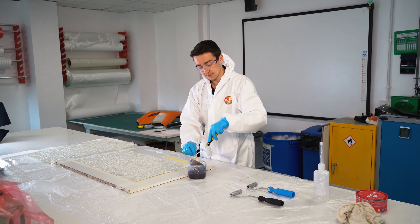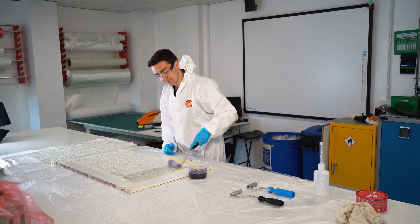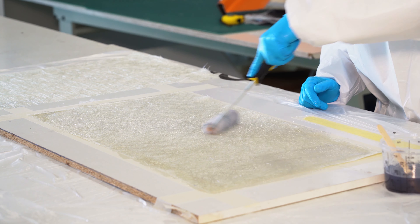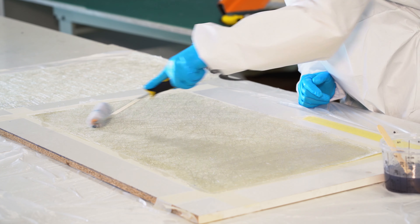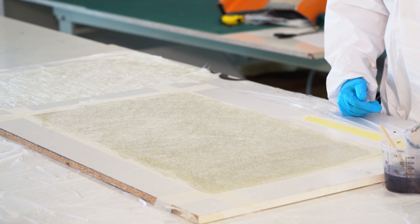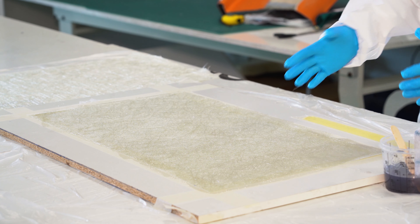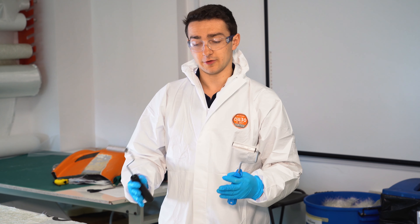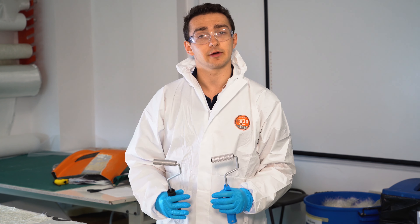The next step is to grab a little bit of extra resin and just coat it once again. As we can see, the colour of the fiberglass has already changed — it's become more like the resin. That's all of that resin soaking in. Once we put the resin on, it's already starting to go a dark green colour. So, once we have our fiberglass and resin on, the next thing we need to do is consolidate — that's essentially pushing all of the air out between the layers.